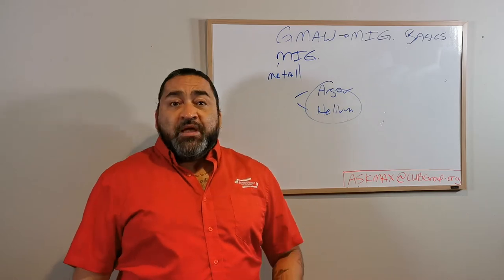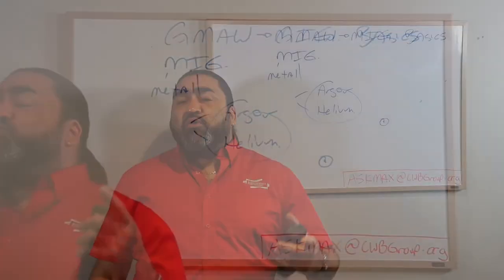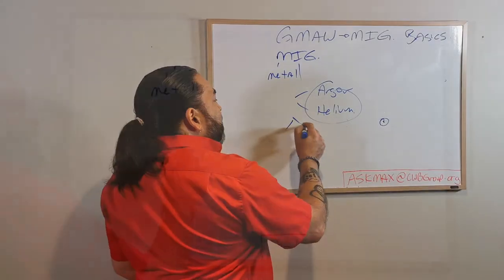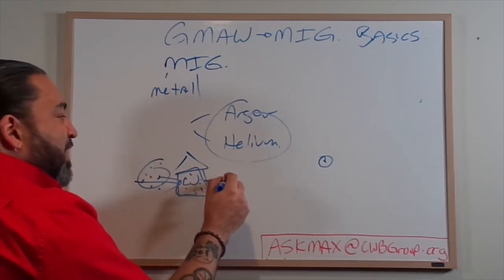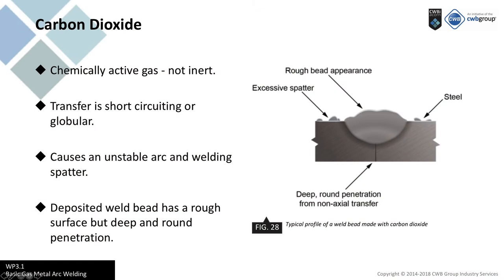Helium is very different. Helium is also inert, but it's tiny - it's a tiny little molecule. It's number two on the periodic table; there's only one thing smaller and that's hydrogen. Helium doesn't have that bouncer mentality - it doesn't come in like a big brute to push guys out of the way. What helium does is take power and pressure in numbers. It's like having 300 ninjas show up instead of one giant bouncer. In the welding party, all the nitrogens, hydrogens and oxygens are in there, then a busload of helium comes in and pushes its way in, kicking everybody out and replacing them with helium. Again, helium is an inert gas, so it's not going to play with the other guys - they won't join or become part of any equation.